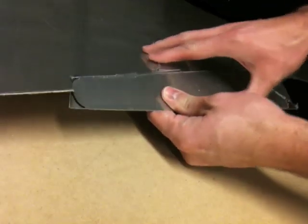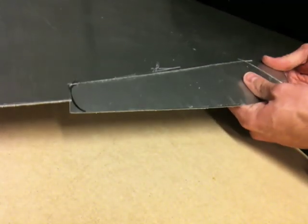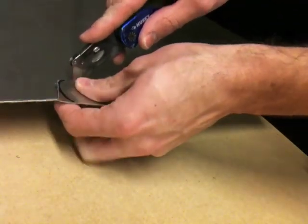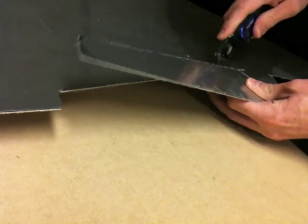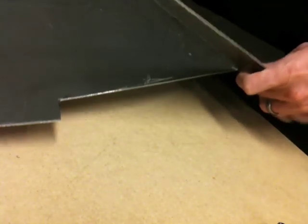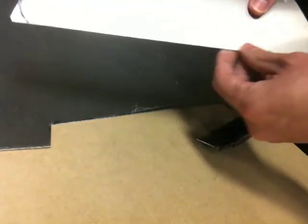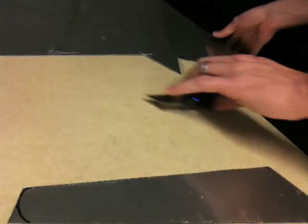Just be careful to bend only a couple of times — you don't want to bend too hard in any one place because you'll end up putting a permanent bend in the aluminum, and you obviously don't want that. Then I come back and use an X-Acto knife to cut the plastic, since this aluminum is coated on both sides. Bending and breaking the aluminum won't tear through the plastic except on the side that you scored. It takes just a couple of bends and it breaks away — and there we go. Now we have our raw piece pretty much cut down, with just a bit more work to do to finish off where the lines are going to be.